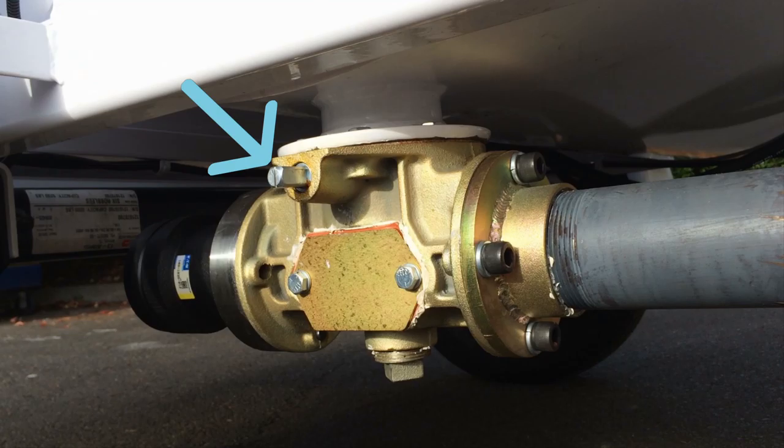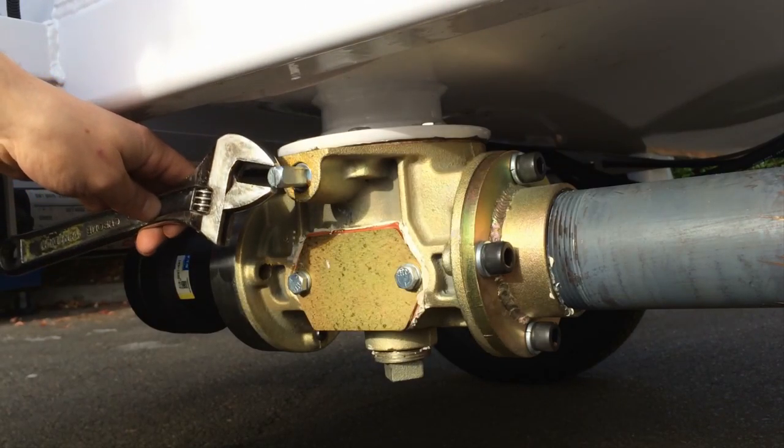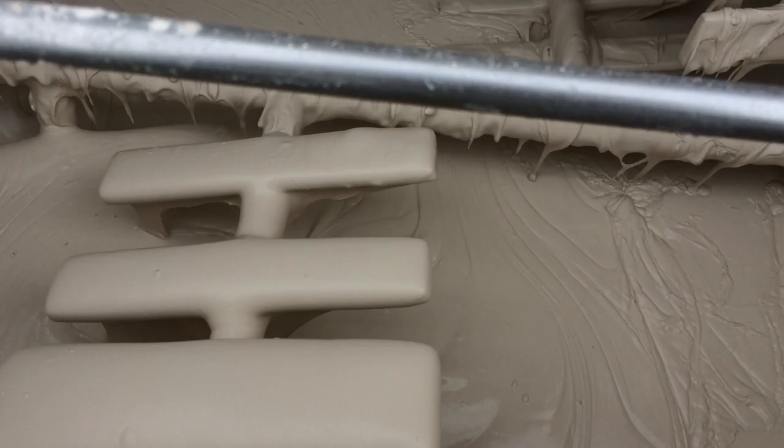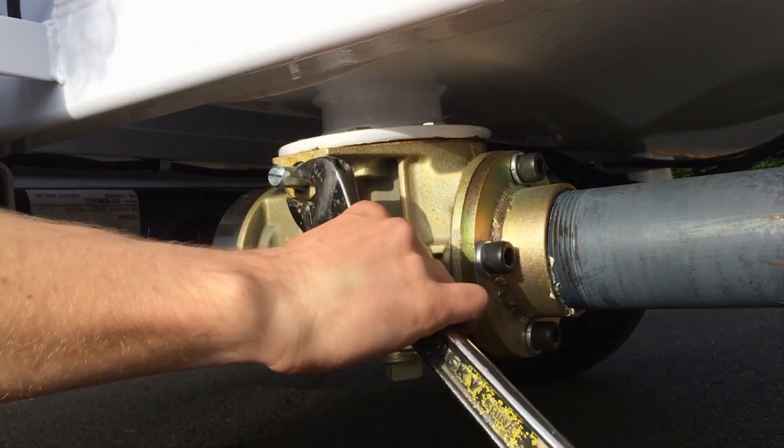The HD Pump Housing has a butterfly valve at the top between the tank and the moving parts of the pump. To stop the mud from flowing into the pump housing, simply turn the butterfly valve. You are then free to service your pump with a tank full of mud. To continue spraying, just open the valve back up.